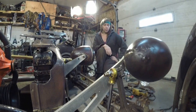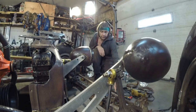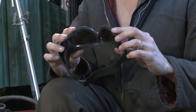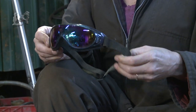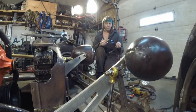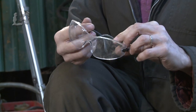While I was welding, I just want to keep in mind that you should use the proper eyewear. I do have a pair of glasses — you've seen them in my previous videos, they look like ski goggles. There's foam inside so they're very comfortable, because if they're not comfortable you're probably not going to use them as much. The tint on the ski goggle is actually the same tint number as on my welding mask. When I'm grinding, I'm always using my safety glasses, and if I'm grinding on a bigger area, I'll use a safety shield.